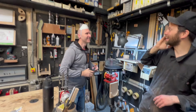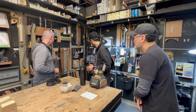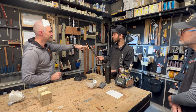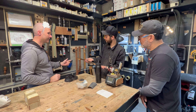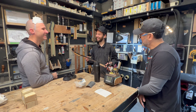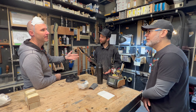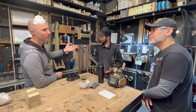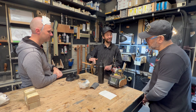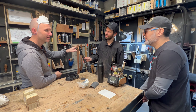Hi, I'm Kathy. So Aido does the necks here — this is our little machine. What are you doing to this one at the moment, Aido? I'm just putting tuners on that now, wiring it up, and getting it ready. Once I've got the tuners on, I get to hand it off — it's the final stage of this neck. Yesterday we would have oiled this up and now it's ready for tuners. This is a blackwood binding — we would have prepped that and sprayed it. The blackwood binding has to get sprayed multiple times and then gets scraped around the edges to get a really clean edge.